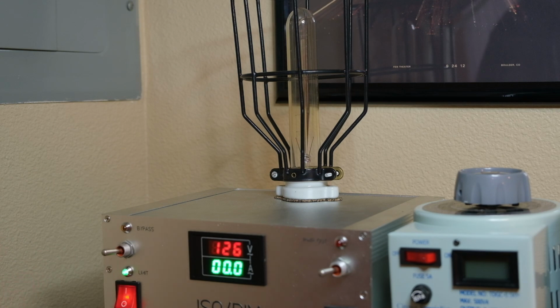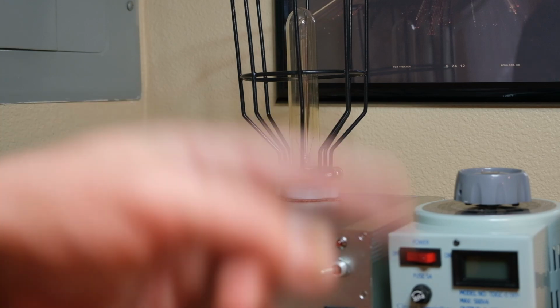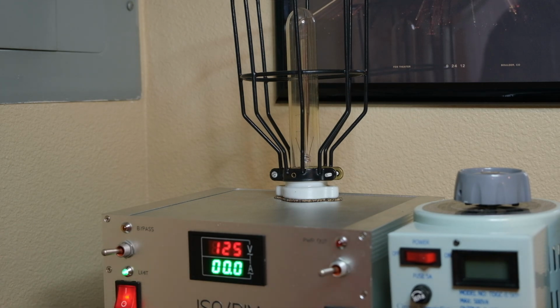That's just V equals IR. So, 60 watt limited to a half amp. You can go lower. You'll see designs out there, especially on YouTube. You can switch in multiple bulbs. You can add them up. You can subtract, so you can limit your current as you see fit. I just went with one.